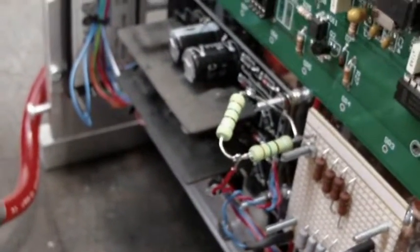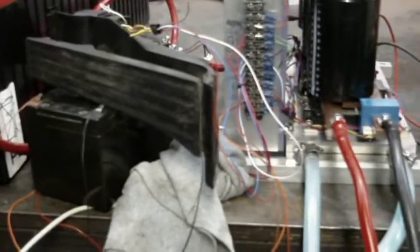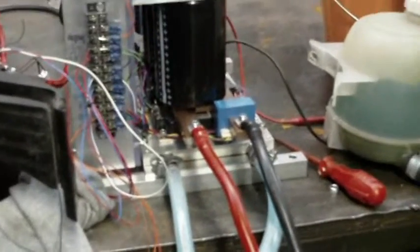Amazing what difference those little resistors did for us there. You just changed the behavior of the controller entirely. I'm probably going to be happy to sacrifice a little bit of performance, or sorry, efficiency in terms of slowing the switching speed, just to ensure that the transistors and freewheels are happy in there.